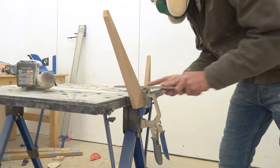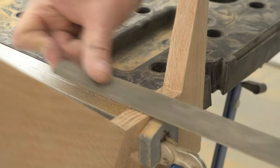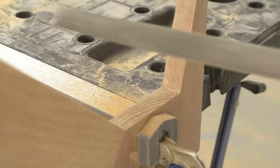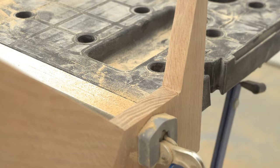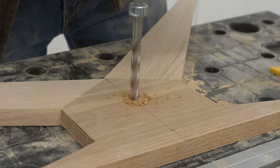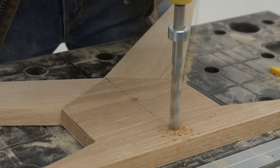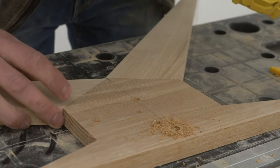A flat file really came in handy for getting rid of some of the burn marks that were left behind from cutting, which is common with red oak. I pre-drilled a couple spots where I'm going to recess screws and connect one of my side pieces through the face of the big hub piece, and the other will connect with pocket holes. I just made sure that neither of those are going to line up and hit each other.